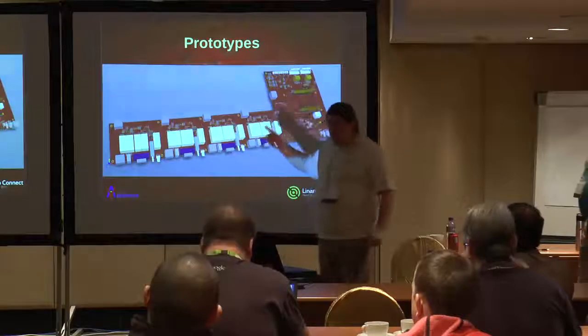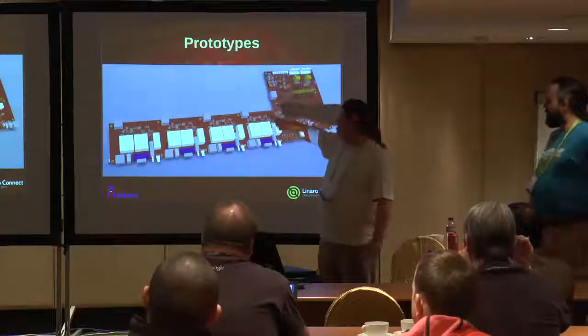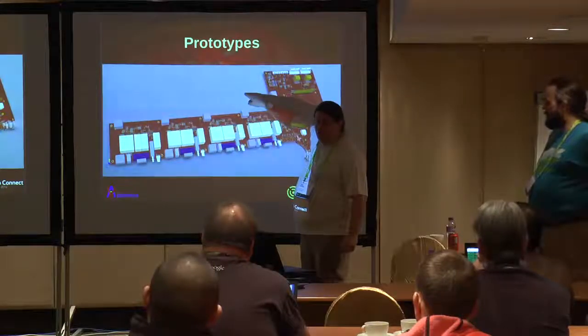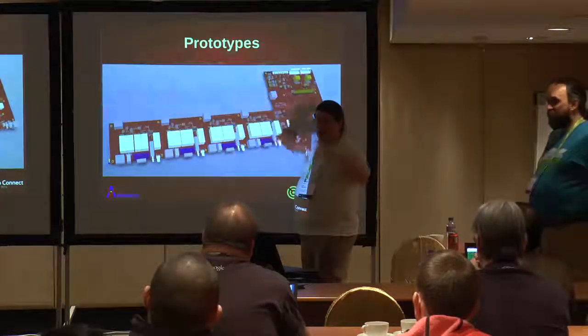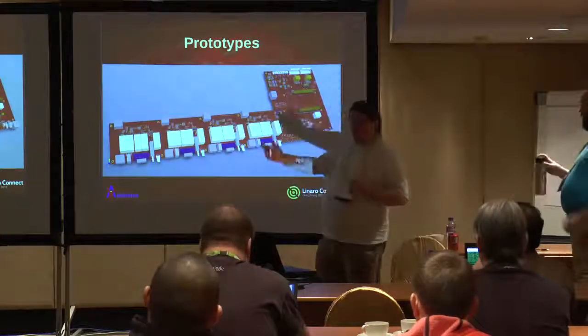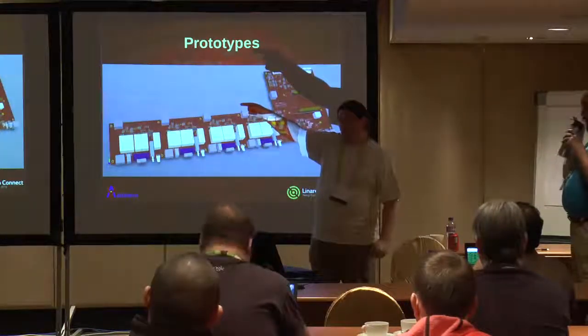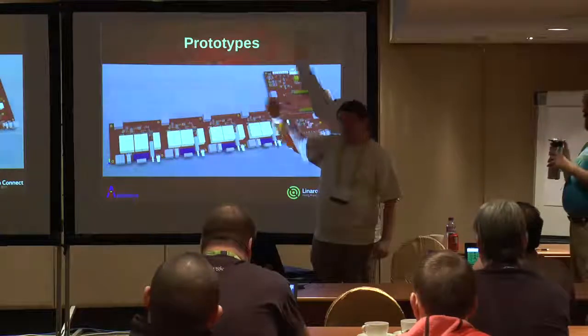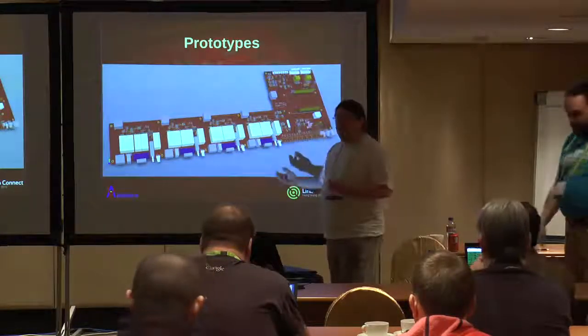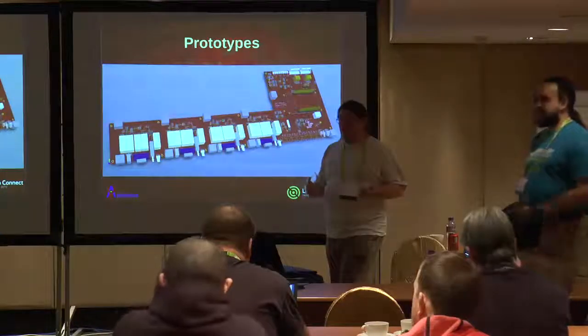So if you're using PoE, you're going to end up replacing the packet switch inside the unit. Maybe you're going to run an external PoE system. With PoE, you can tell the switch to turn power off anyway, so I'm going to expect you to have an Ethernet connection to the switch, so there's already the mechanism there to turn off individual power channels.